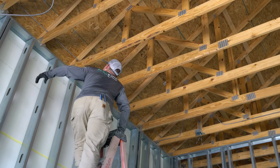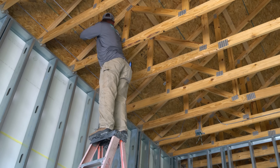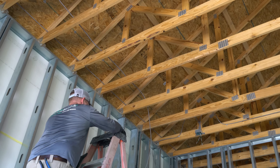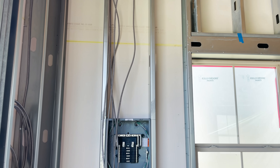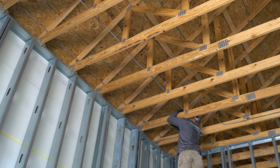After getting the panel up, I installed all of my home runs. A home run is what we call in the field the conductor that goes from the panel — from a breaker — all the way out to the field, and once it hits a device it branches out. That one piece of wire from the panel to the first device is the home run. It could be called a feeder in certain situations, but this is a branch circuit, and the home run just identifies that one singular piece of conductor.